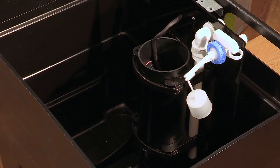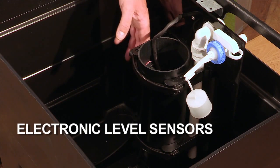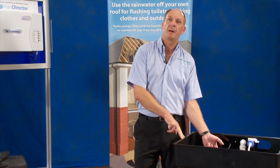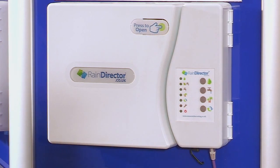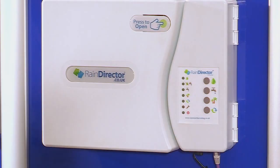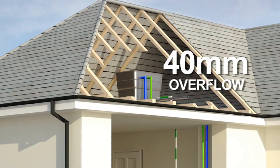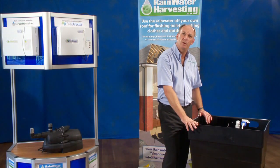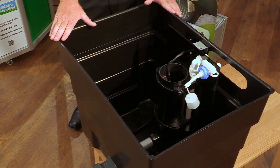We have a number of safety features built into the system. Firstly, we have an electronic level sensor built into the header tank. When shut, this will send a signal to the control panel, which will alert the pump to stop pumping. When we first commission the system, it fills itself up three times, each with mains water and rainwater. The control panel calculates the average length of time the pump takes to fill up the header tank, notes the average time and logs it into its memory banks — that's the second safety feature. If the first one fails, the system knows how long the pump needs to pump for, and if it goes over that, it will cut the pump out. Lastly, we have a 40mm overflow in the header tank, which is plumbed to the exterior of the property and is designed to cope with a large volume of both mains water and pumped water going into the header tank at the same time.